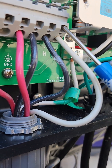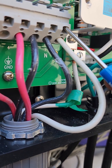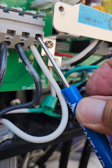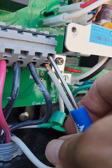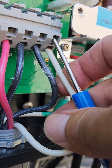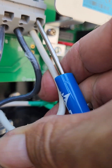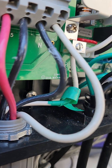These jaws work to release them — you actually push down. So the jaw that holds the wire nice and tight in there is released by pushing down. When you push down, you can see that we can pull this wire right out. So again, just doing it opposite — we're going to push the jaws down with a screwdriver at a 45-degree angle to get the wire back in there and release it.